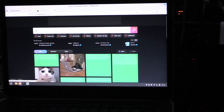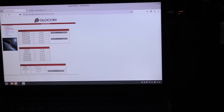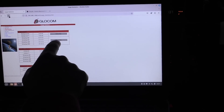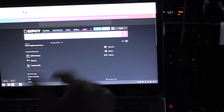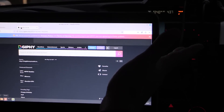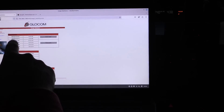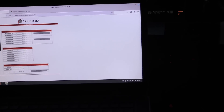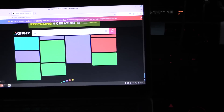We have one image loading, then two. How many cat gifs can we get before we're out of data? We've used 3.167 megabytes. Things are slowing down — 5.4 megabytes, we have used up all of our data. We've just blown through 2.5 megabytes and we don't even have many images loaded. We can load about a dozen cat gifs before we're out of data on a modern connection. The Inmarsat terminal is kind of useless for the modern day and age — really useful for a Commodore 64 in text mode chat, but not useful for anything modern. We're actually up to 7 megabytes — I didn't think I had that much on the SIM card. It might wait 30 seconds or a minute to integrate the data use before cutting off. Either way we're basically out of data and it's not letting me load anything else.